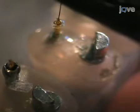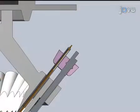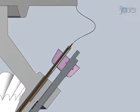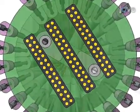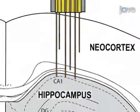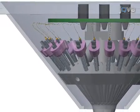Continue loading a total of 18 tetrodes. The three remaining microdrives on the array will be used to house the reference electrodes. Each reference electrode is made of a tetrode that uses only one of the four unbonded wire ends. To attach the reference electrodes, follow the loading procedure but attach only one of the four electrodes to the respective reference electrode pin on the connector board. If you are planning multi-site recordings, it may be worthwhile to plan out the connections from the tetrodes to the connector board ahead of time. For example, cluster tetrodes that are targeted to one anatomical region together on the electrode interface board. This should minimize the possibility of adjusting the wrong tetrode during experiments.